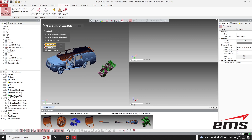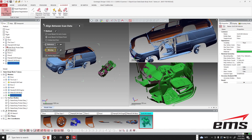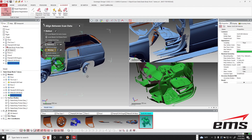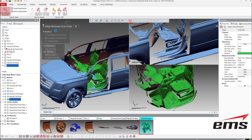And we're going to do it based on pick point. Our reference will be the main body, and our moving part will be the GoScan interior. We're going to get them in similar views. I scanned just enough of the interior to give us something to align to. We'll pick three points fairly close to each other, then pick here, here, and here. They don't have to be perfect, just close enough — you'll see they're roughly aligned. Then we'll hit OK, and it will take those three initial points and fine tune and align the scan data so that it lines up perfectly.